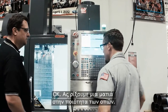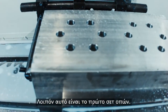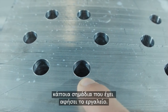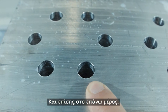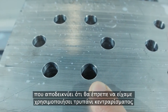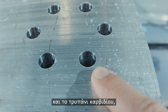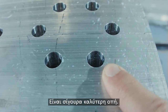Let's take a look at the hole quality. So let's look at that first set of holes — tell me what you see there. Where we used the high-speed steel, you can actually see that there's some tool marks, so the finish isn't very good. And also on the top, you can see that the hole's bell-mouthed, proving that we should have used a center drill to actually prep this hole. When we look at the holes with the through spindle coolant and the carbide drill, we see a much better hole, much better finish, and you don't see that bell-mouth. It's definitely a better hole.